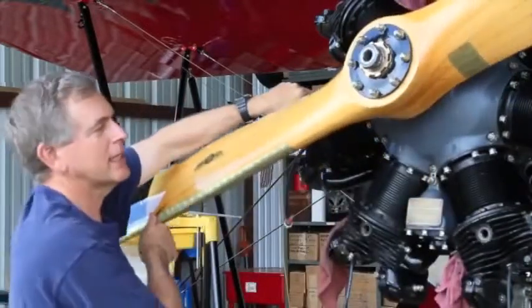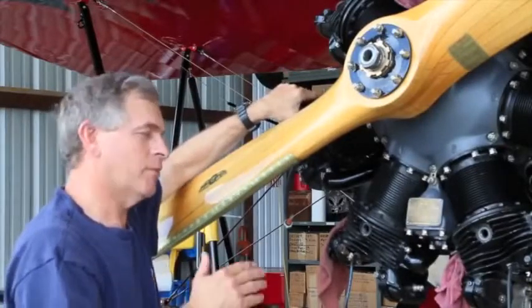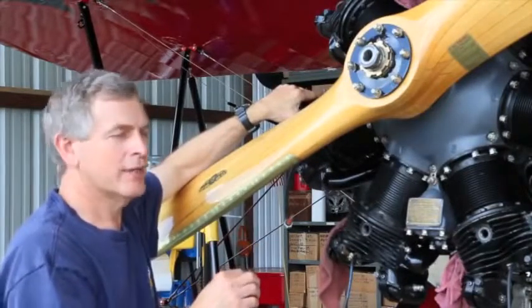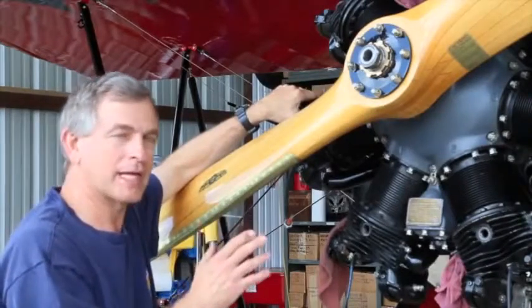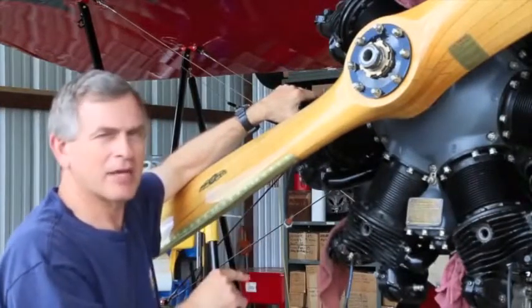This is the one we just did. And I wouldn't expect it to be as strong as it will be. It will probably get better. There may be some particles of grinding compound still left in there that might allow it to not fully close, or it might leak a little bit. But we've done our best to clean it out. We have improved the compression, and we think it'll get better as the engine runs.